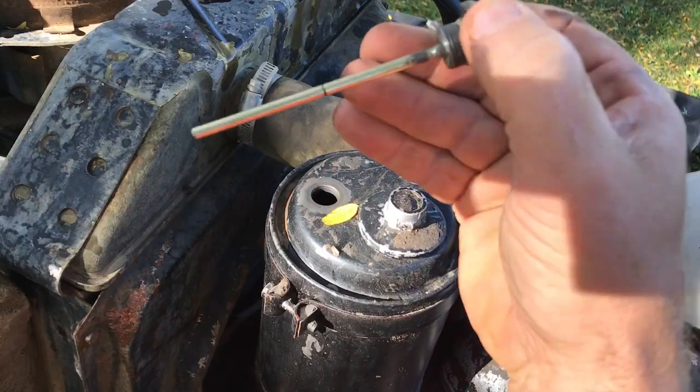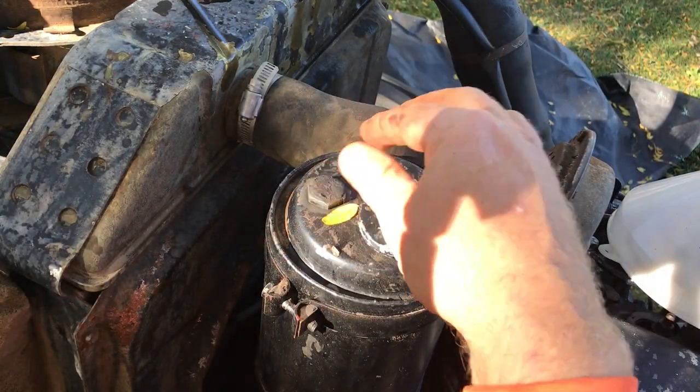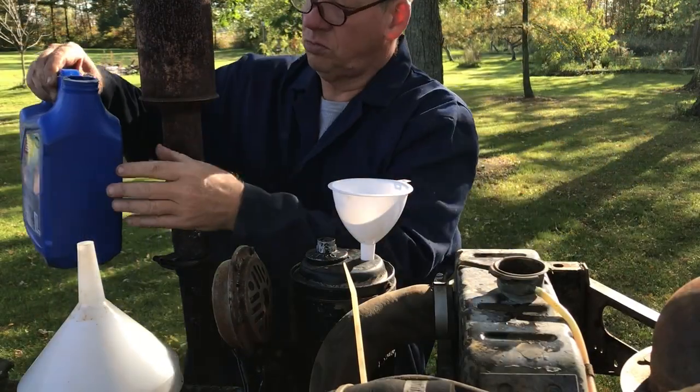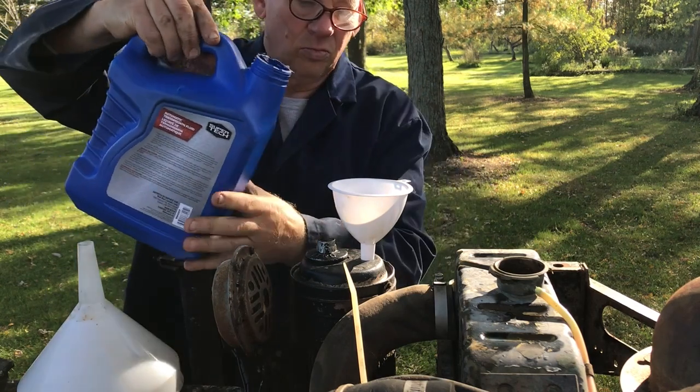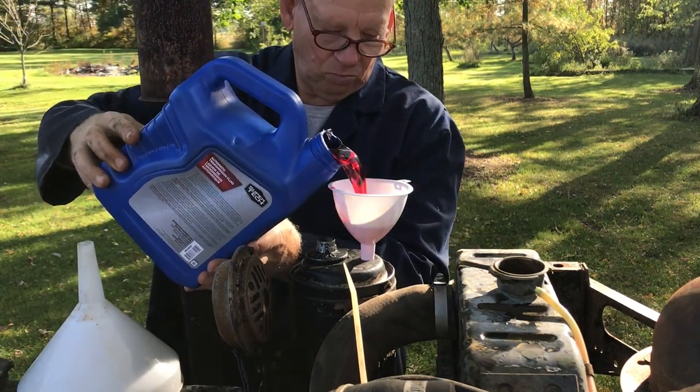While all that's going on, I'm going to take a look at the power steering system. The reservoir is bone dry, and it appears that one of the hoses wasn't all the way tightened at the cylinder. The wheel is a real bear to turn without it, so I hope this is a simple fix.